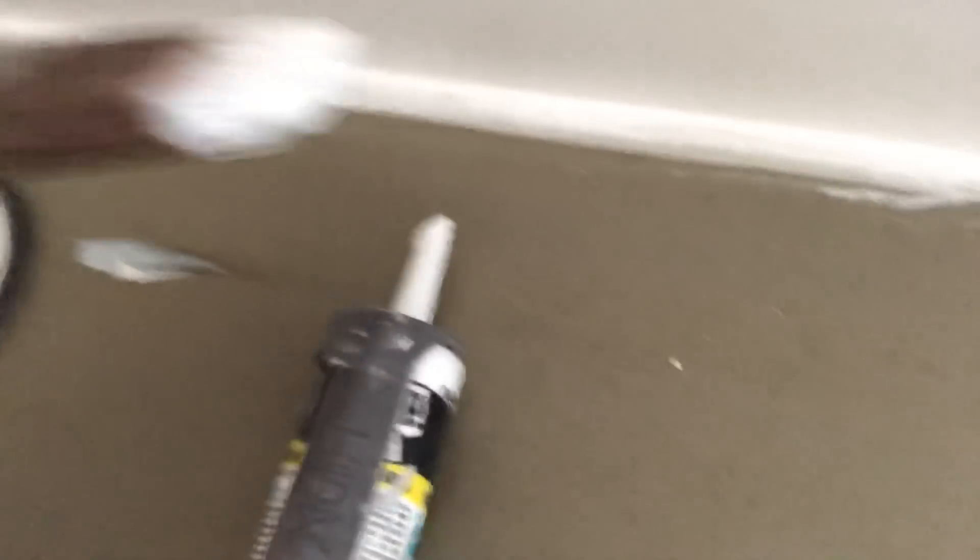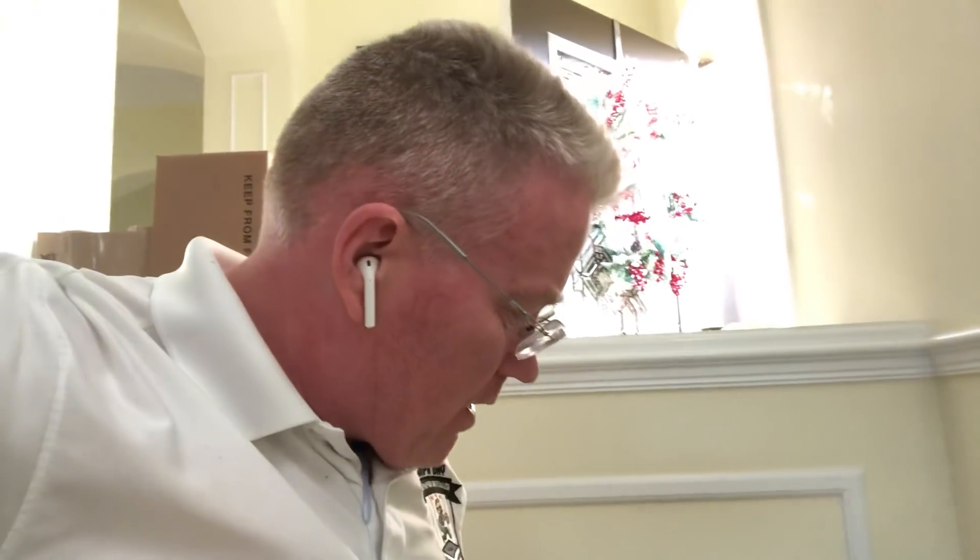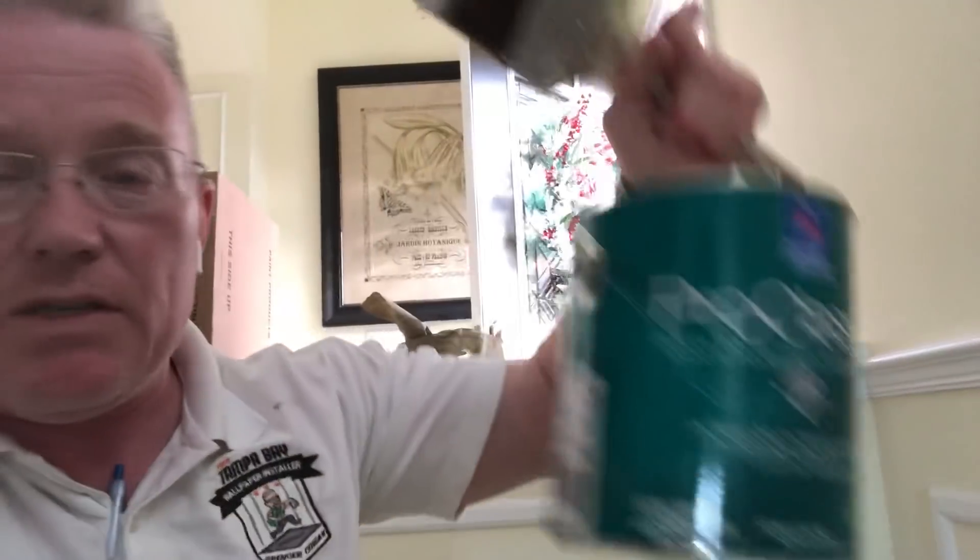Here's an example of what I was talking about — I just touched the surface where I told you not to. You might not be able to see it straight on, but if you look at different angles you can see where I've disturbed the drying process of the paint. I'll go over that section because you want to render a really perfect, uniform surface. I could load up the brush again and pull the paint in one direction. This happens to be really good paint — it actually melted together. I don't want you going back touching it more than two minutes later, but I'm using one of the finest semi-gloss paints on the market: Pro Classic from Sherwin-Williams. It's a really good product, very thick paint — you don't add water to it unless you're putting it through a sprayer.